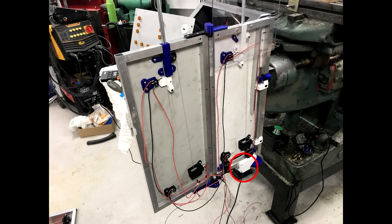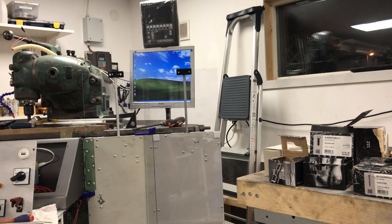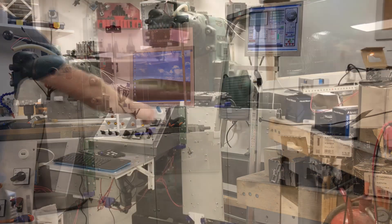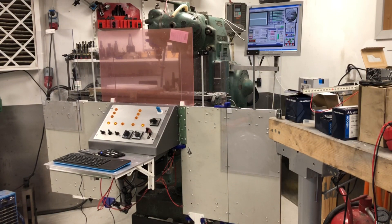With this setup there's one motor per side for folding the door pair in and out, and two motors for winching up the windows. The winch motors are about the size of a thumbnail, so he was actually quite surprised that they managed to lift the windows up. Here's the first prototype of the doors done — lots of small pieces that have to work together and maintain tight fits, which was actually impossible with his riveted design. Overall he judged this prototype as a failure, half due to the doors not being able to fold reliably with the gears falling out of mesh, and half due to the windows not being reliable enough.